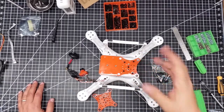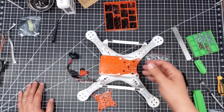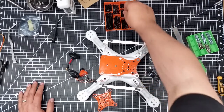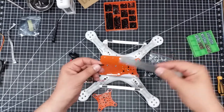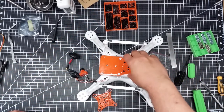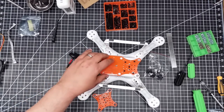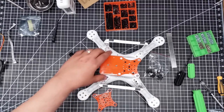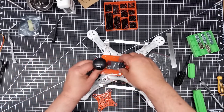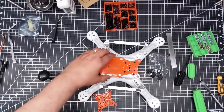Okay, so we're back — I've mounted this. Maybe you'd want to put these on first, but I can still get to them pretty easily. Here it is all assembled. I used four 10mm M3s with lock washers under each of them to hold it tight. I also used two quarter inch number four screws, which I drilled a small hole for. These just barely pass through the body. I didn't want the back piece flapping because I'm going to use this Mushroom antenna on the back, and I didn't want it pulling and potentially breaking the back piece. With these two screws, it's definitely very secure.